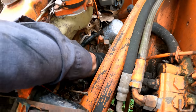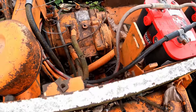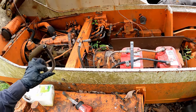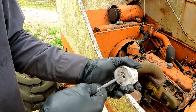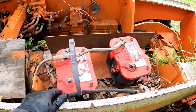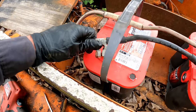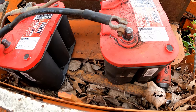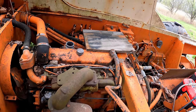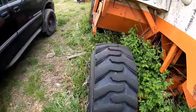We'll tap some diesel into that — that's coming over the supply right there, smells bad but not as bad as old gasoline. I just had to disconnect the batteries because I smell something burning back here. We do get a little arc when we hook the battery up, so we definitely got something drawing current. We're hooked back up, ready to do a crank test.